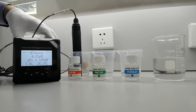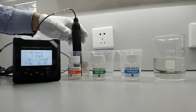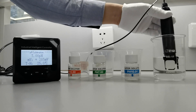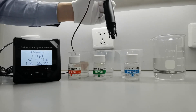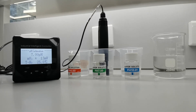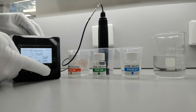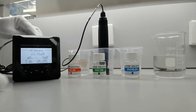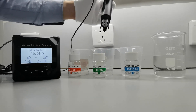After the measurement is stable, you can press enter and put the electrode back into distilled water to rinse, then immerse it in pH 7. After the measurement is stable, you can press enter and rinse again with distilled water for the next buffer solution, pH 10.